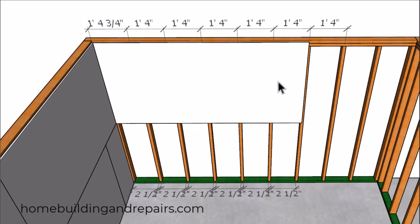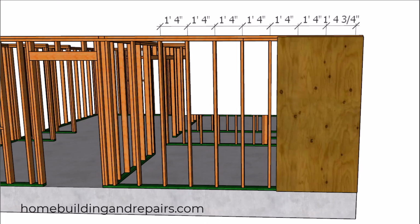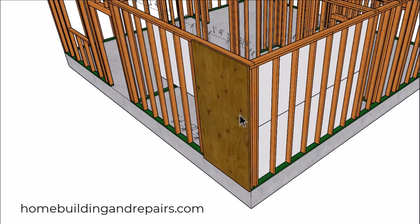Now that you have all of that, what if you're going to be installing plywood siding? Well, then now you're going to have to choose between the plywood or the drywall. Which one is going to be more expensive? And that's probably not going to be that difficult because the plywood siding is usually 3 to 4 times more expensive and going to require you to pay more attention to the stud layout for the siding than it will for the drywall.